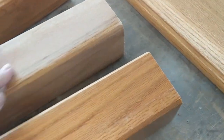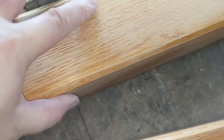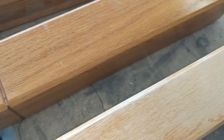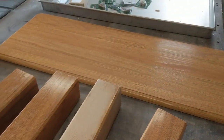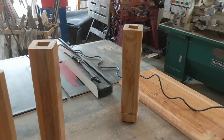The legs are chopped. I gave this one a little sand to see how it's joined and it is nails — you can kind of see them there. I don't want to run those through the table saw because the blade will hit them. So I'll get these all sanded down because the wood looks nice, but before I do that I'm going to chop this down, get it squared up, and work out if I'm doing a single top or a little parcel shelf as well. I need to do a little layout so I know exactly where things are going to go.